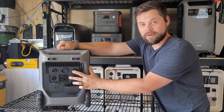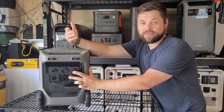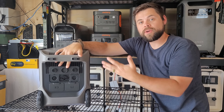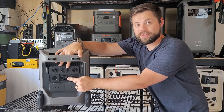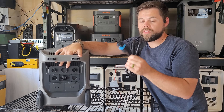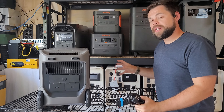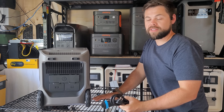You can use this charger here which will also do up to 3600 watts from any type of clean energy source — so if you're using a gas generator it must be an inverter gas generator. The unit comes with both a 15 amp and a 30 amp charger, so if you have access to an RV plug you can get a full 3600 watts of input, and it even has pass-through capability as long as it's the 30 amp connector. With the normal 15 amp connector once plugged in, the UPS function drops down to 1800 watts. If you exceed pulling 1800 watts from the outlets while charging, it will shut off the UPS function.